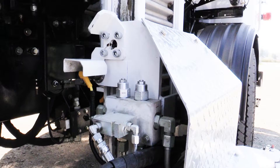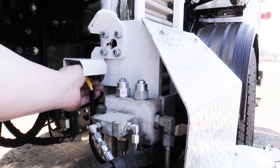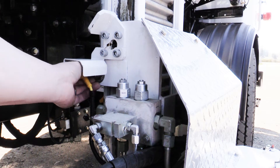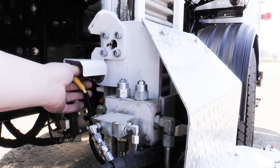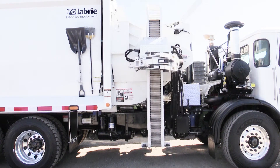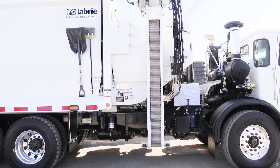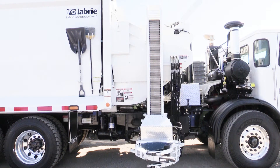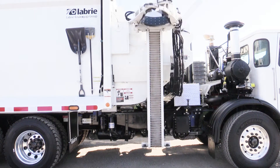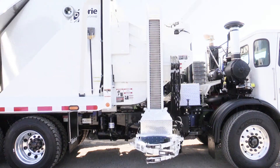We will begin by looking at the proximity switches located on the gripper carriage. First we'll look at the arm-up cushion. This cushion activates when the switch goes to the normally open position. If this switch fails to send a reading at the appropriate time, it will cause the gripper carriage to function slowly in the down position. A good way to determine if this switch is functioning properly would be to operate the carriage in the down position at the Parker VPL valve. When operating at the valve, no cushion is activated.